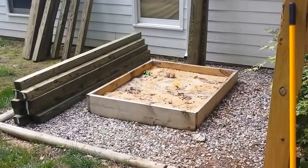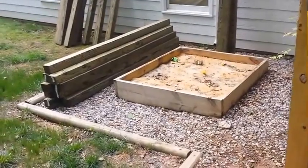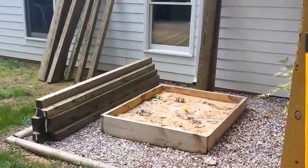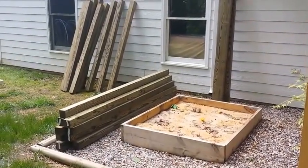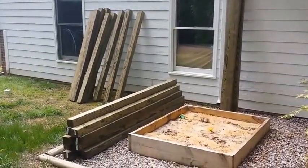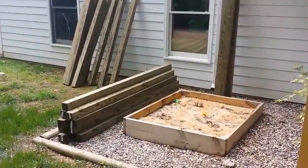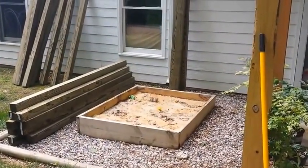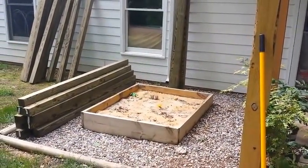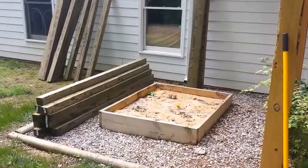All right, this is the pond building site. I just wanted to show what it looked like before I built my structure. I bought a bunch of 4x4s. So the 4x4x6, those are the ones on the wall there. And then the lengthwise ones are 4x4x8. So the pond's going to be roughly 8x4. We're going to go 6 high on both sides. So 6 up, all the way up there, roughly around 22 inches or so.